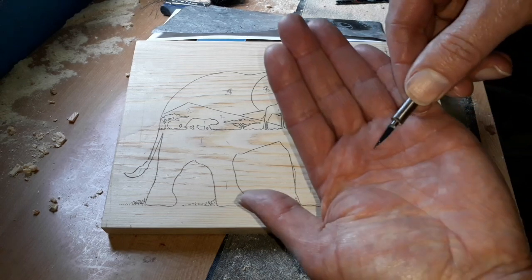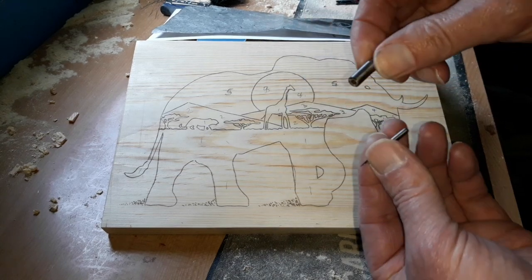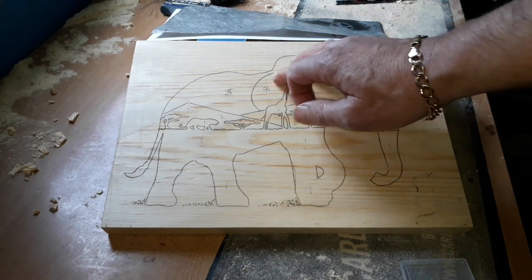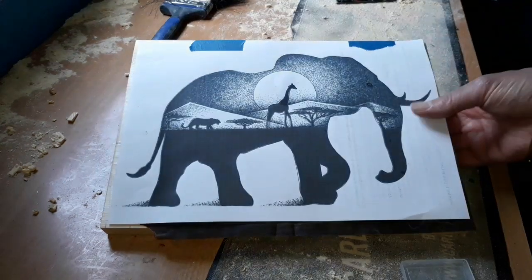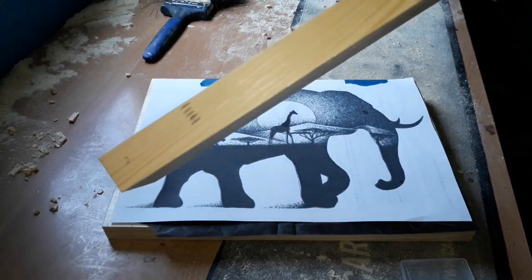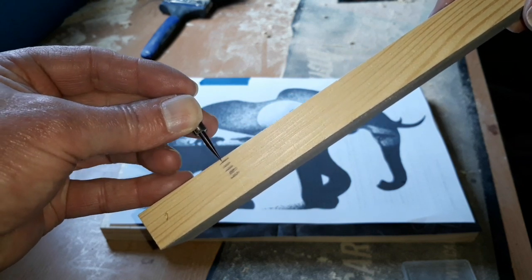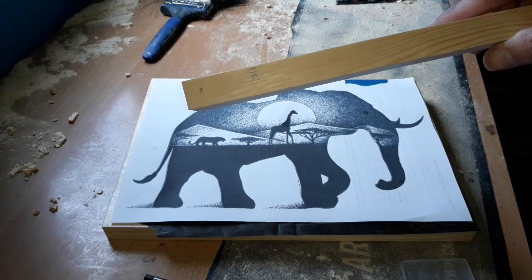These are the bits I'm going to use — CNC bits, absolutely fantastic. You need what they call a little collet, and that basically just slots on there and gives you a quarter-inch shaft that will fit into your router no problem. We'll start with the deepest first and as we come up we'll do the numbers — so we're carving by numbers basically. I've actually marked five little marks on the back side here, so number five will be set to that one, which is plenty deep enough, and then number four to the next mark, up again to three, two, and one is literally just enough to show we've routed it out — that will be the black outline. So okay, that's enough talking, let's start routing out.